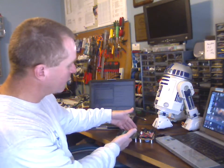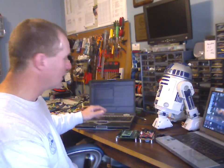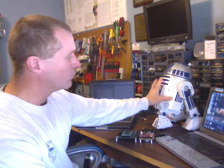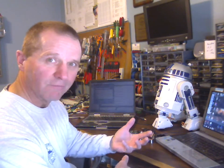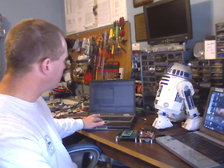This was all developed after I bought the development kit for the SmartVR module. It comes with an integrated development environment installed on this computer and quite a large suite of software needed to develop a speaker-independent voice recognition system. That was the biggest challenge — I wanted this to operate similarly to the toy so that anyone should be able to come up to it and issue commands without having to train it for their voice. That's where speaker-independent voice recognition comes in. It takes a little more processing power from the chip, and working through it took quite a steep learning curve since I'm not a C programmer.